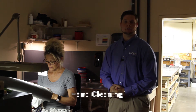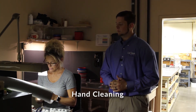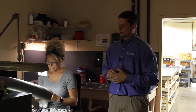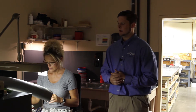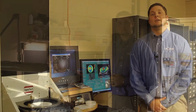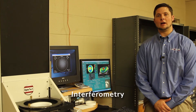After we've ground and polished both sides and gone through centering, we need to get the optic cleaned. We're with Shauna in hand cleaning. Shauna is going to clean the optic, ensuring there's no oil, no residue from processing before we go to coating. After the part has been processed on both optical surfaces, we're going to verify the optical surface with a phase-shifting interferometer to ensure the part meets your spec.